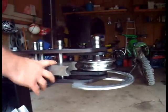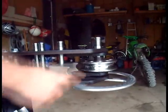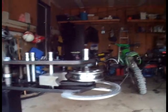Note that in order to bend, the surface of the follower block is to be lightly greased and the surface of the die is to be kept clean and dry. At this point, we're ready to get our tube.